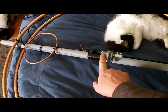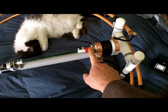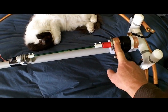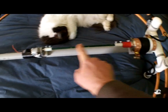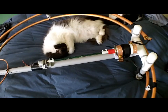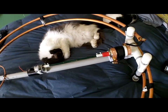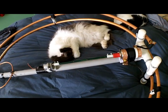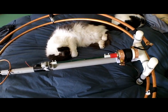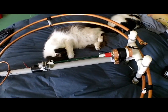Efficiency is key. The motor drive — you can get this for around $10 from Amazon. This is how I coupled the motor to the variable cap. These are sacrificial bushings I made up. The cap stops at the end of its travel, so instead of destroying the cap, I put in a system that will break before the cap does. So far I haven't had any issues. First contact was with the Bahamas — that was two or three nights ago, on eight watts, with the antenna sitting right outside the kitchen door on the back patio, practically right on the ground, about four feet off the ground, right next to the house. Eight watts gave me a 5-7. He was a 5-7 to me on a dipole on the beach running 100 watts.